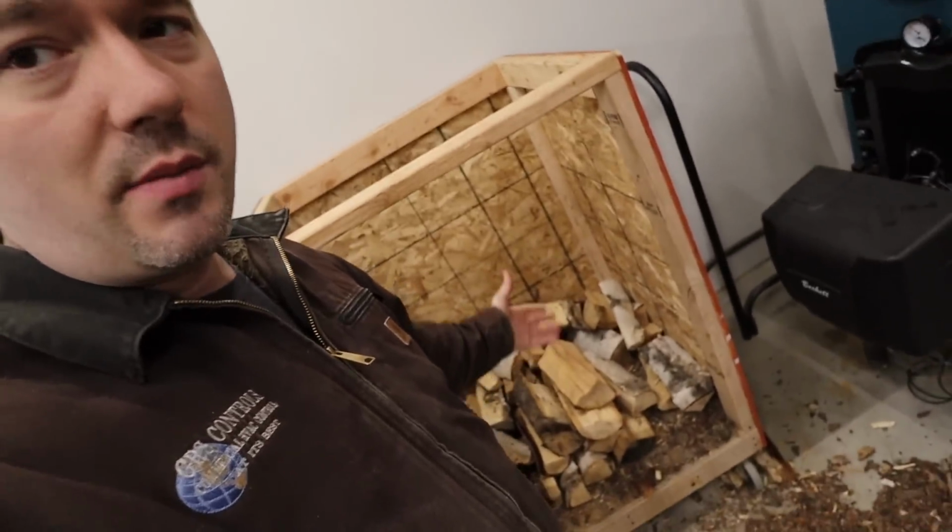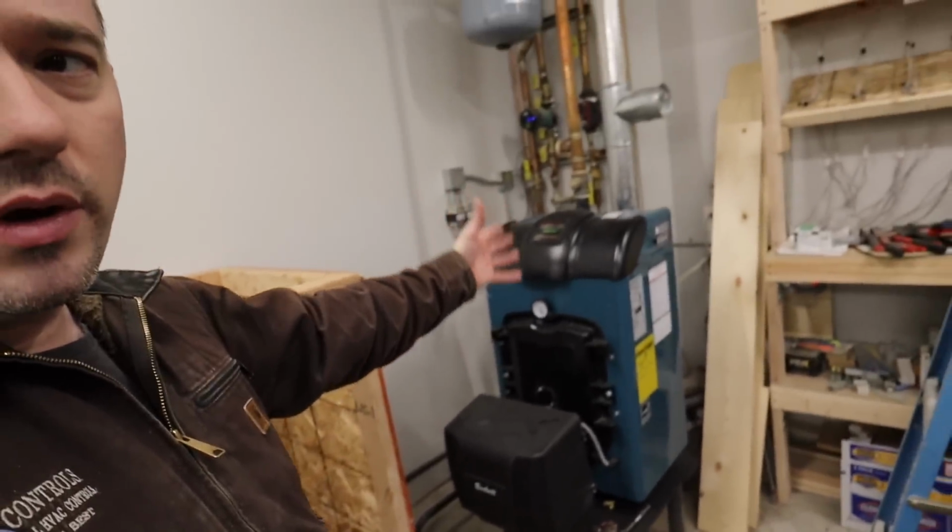I forget that so many of you are new to the channel, and we so appreciate each and every one of you. We heat primarily with wood, and then we have a boiler as our backup heat source. Boiler goes into a mixing valve and goes into the floor, so we mix the temperature so that you don't burn your feet, because we have radiant floor heat. So like I said, we're right around 110-ish degrees in the floor. Maybe 115. It's kind of hot between 110 and 115, and that seems to be comfortable for our home.